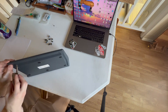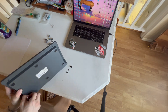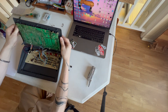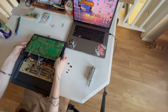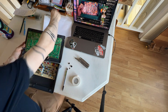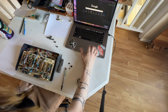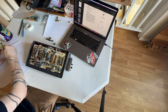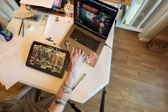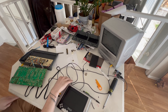There were three screws in the front and three screws under the little foam feet on the back, so I took those out. Once I had everything out, I opened it up, looked at the circuit board inside, and had to take that out too because I couldn't quite see the chips. Here you'll see me looking up all the individual chips on the circuit board, just double-checking my safe pins and making sure I'm marking them with a Sharpie — that way I don't touch anything unsafe.